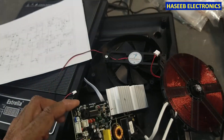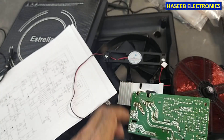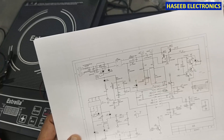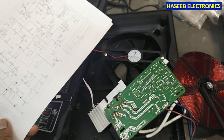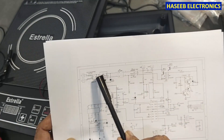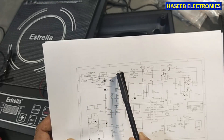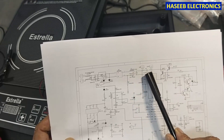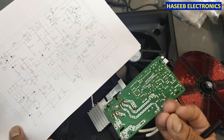We will see the circuit and then we will see the troubleshooting checkpoints - how we can test it. This circuit has two different portions. The first portion is the high power rail that will drive the magnetic resonant coil. It will receive direct voltage from the line voltage, the bridge rectifier will rectify these voltages, and the IGBT will switch between the ground and positive side to make pulses in the magnetic coil.